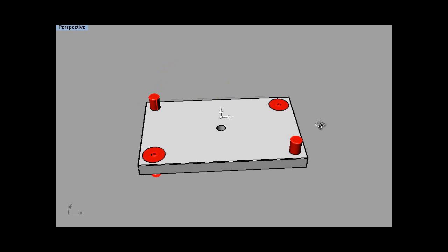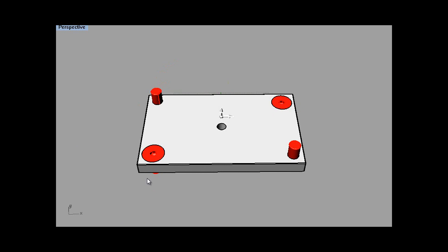Now when you bolt this to your table, another thing to bear in mind is try and get these sides running level with your X and your Y. So basically, if you jog down with your metal bar in and touch there, jog away and jog there, that number should be the same on your Y. So you'd say you're touching that and it's, I don't know, -10 or something. Jog away, jog down to that gently, just really slowly. And then when that's just touching or just above it and you can drop down, it should be -10, and that indicates your Y axis is square.